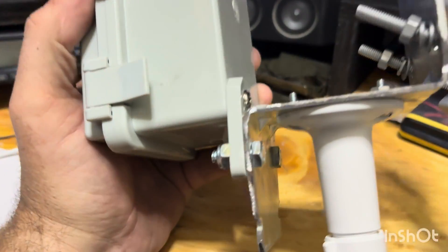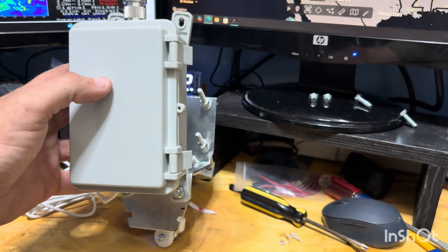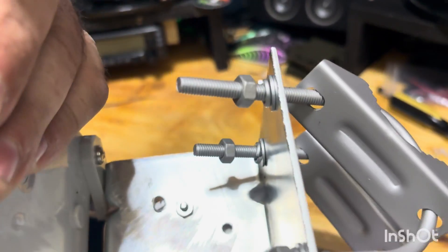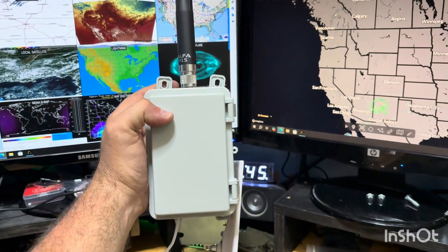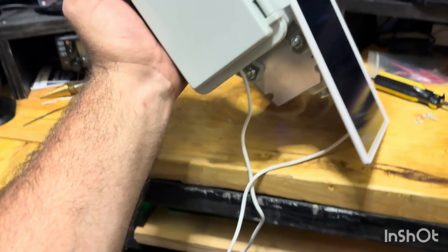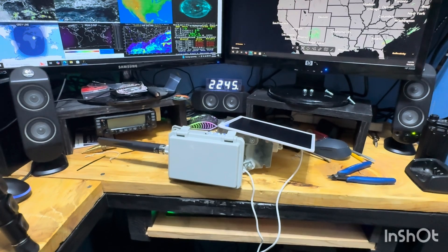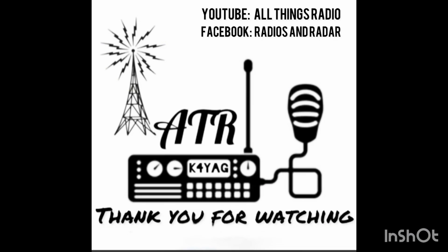The solar panel wire comes in through the USB-C, comes out soldered together, goes back into the solar port. The battery is in the lid — 10,000 milliamp. The coax goes to the antenna, plus the Bluetooth antenna. Lid shut, box all closed up. Going to add a little silicone around it. The solar panel is mounted there — it's a little offset but it should face the sun to charge what's in there. Thank you for watching, God bless.